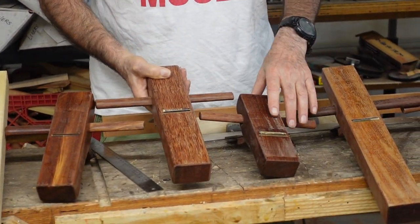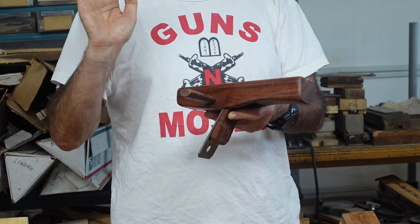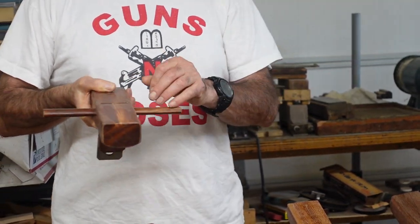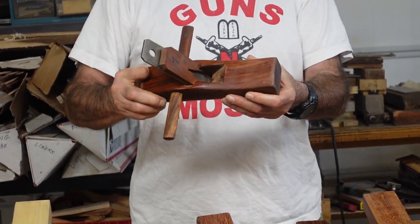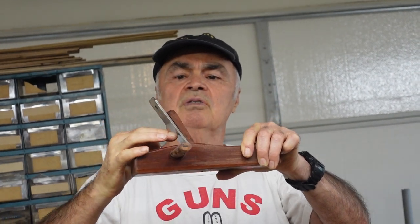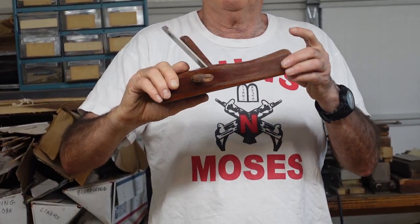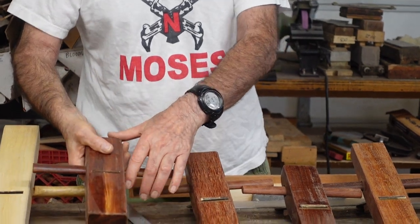Here's a little specialty Chinese plane which I really, really like. I use this plane for hardwoods only — like rosewood, ebony, boxwood, hard maple, and all the different rosewoods. It's also a rosewood plane, but as you can see it has a very steep bevel angle — I believe either 55 or 60 degrees — and the blade is laminated. I'm sure I got this from Woodwell, Woodcraft, or Japan Woodworker. Very, very useful for cutting down hardwoods.